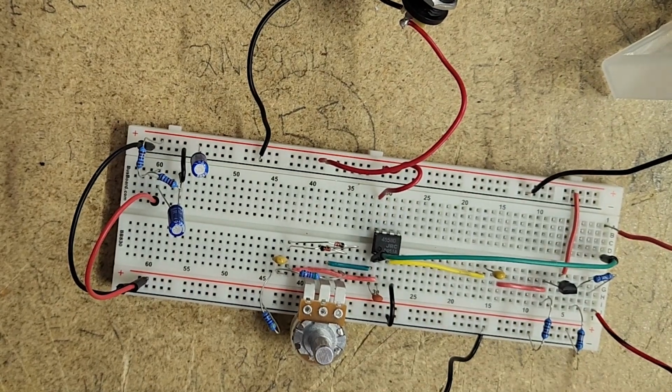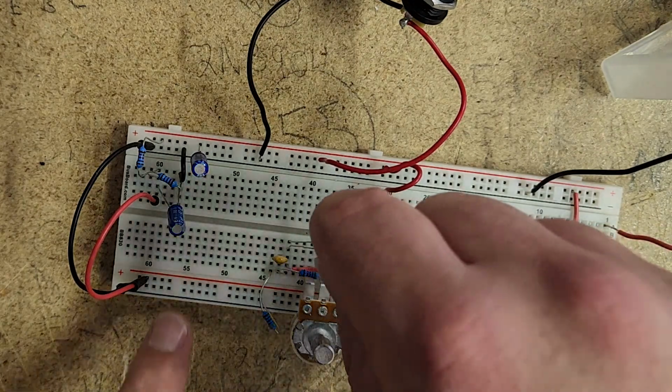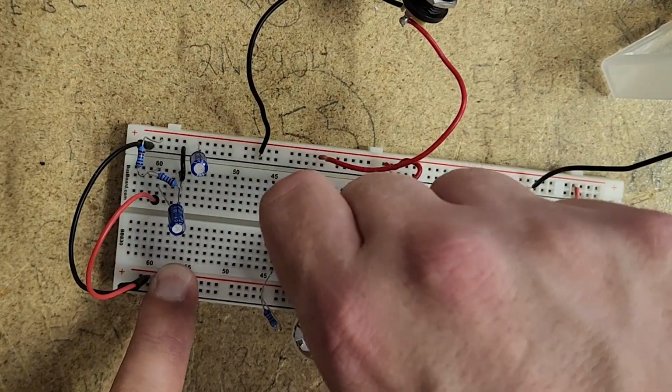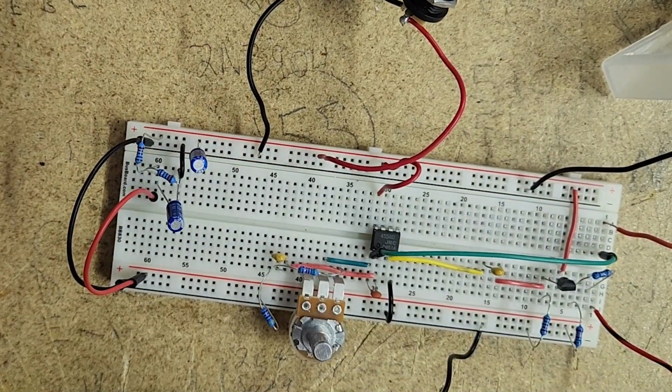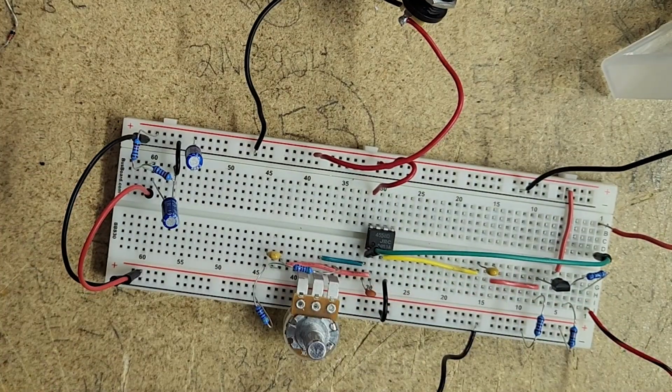And then for curiosity, why don't we also just really quickly take these diodes out, and you can hear that basically all that's happening without the diodes is getting amplified as I turn this up. There will be a little bit of clipping thanks to the op amp, that's just how it works, but we'll take these diodes out so you can hear that. Let's have a listen.